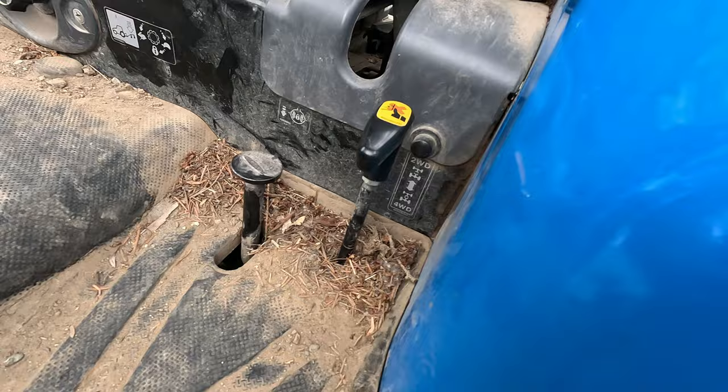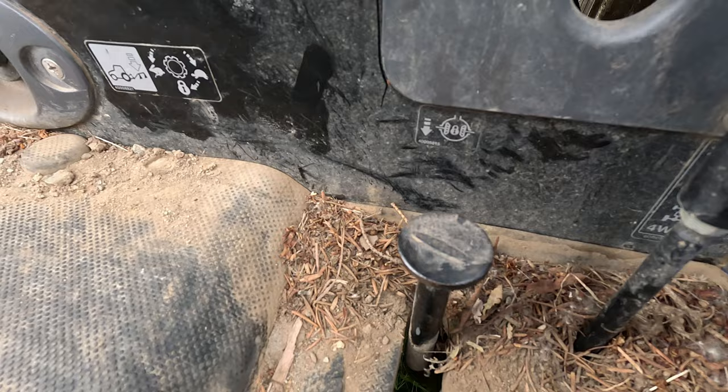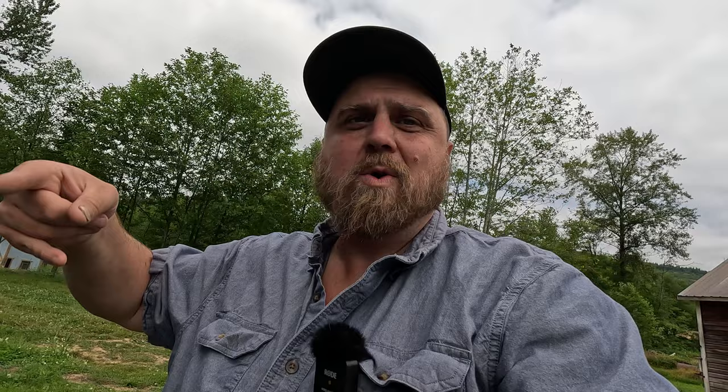This one also has four-wheel drive. Kind of hard to tell, but you push this down and pull it up to turn it into four-wheel drive. Here it tells you that's two-wheel or four-wheel. Most modern tractors on the market are four-wheel drive. And then this pedal right here — that's a rear locker. Most every tractor on the market has this. If you're out stuck in the mud and one of your rear wheels is spinning, you can stop, push that down, and it'll lock the wheels together.